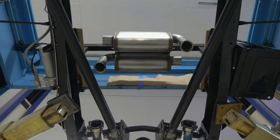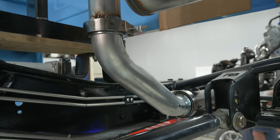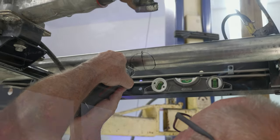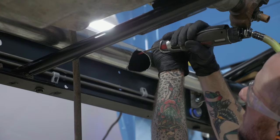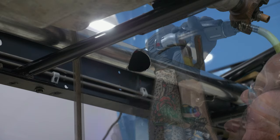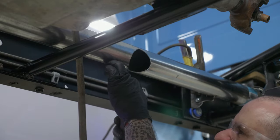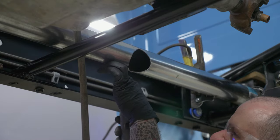As I was working on the exhaust going over the frame rails, I set my dad to a task forward. Since the forward pipes were solidly located, it was time for the crossover pipe. Crossover pipes are basically free horsepower. An H-pipe or X-pipe balances the flow of exhaust pulses from one bank to the other, and this has been proven on a dyno to increase horsepower. The other benefit is it can neutralize some of the harshness of exhaust sound — especially right underneath the cab — mellowing out harsher, raspy tones that a lot of people are not fond of. The benefits of a crossover pipe are well worth the little additional labor involved.